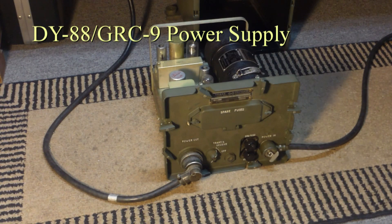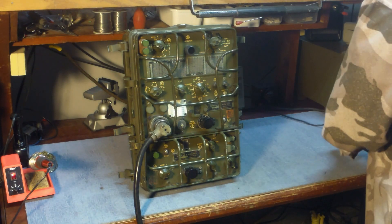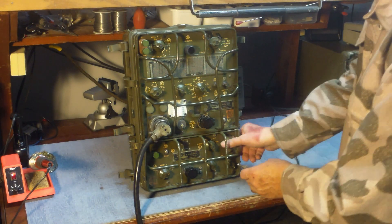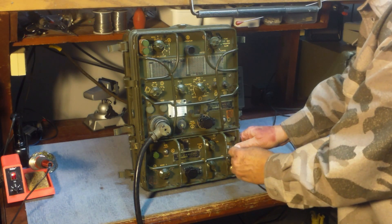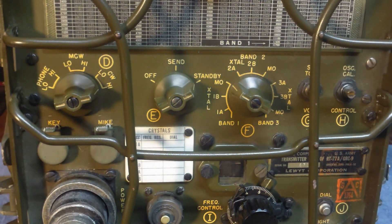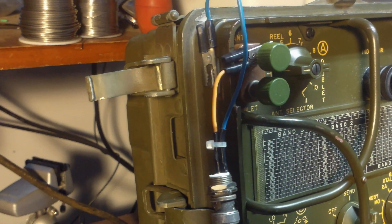For the transmitter, it actually has the big black dynamo which comes on when you key the transmitter. We'll go ahead and plug a speaker into it — the receiver won't come on until something's plugged into the headphone jack. Switch it into standby, which is receive mode, and connect the antenna. We're using the whip input on 40 meters right now.